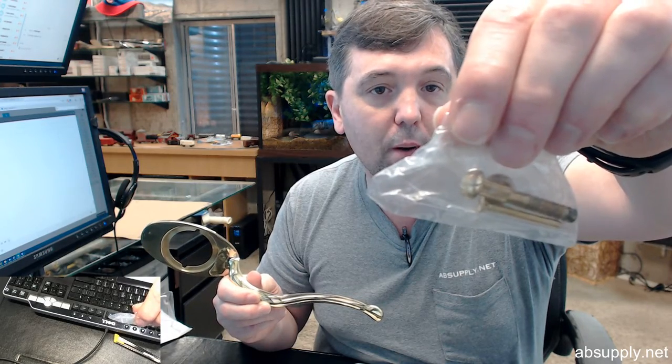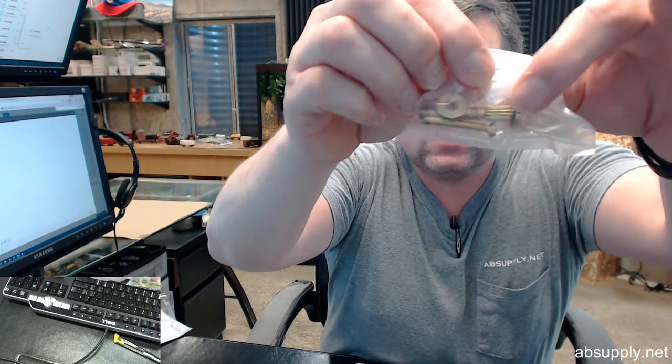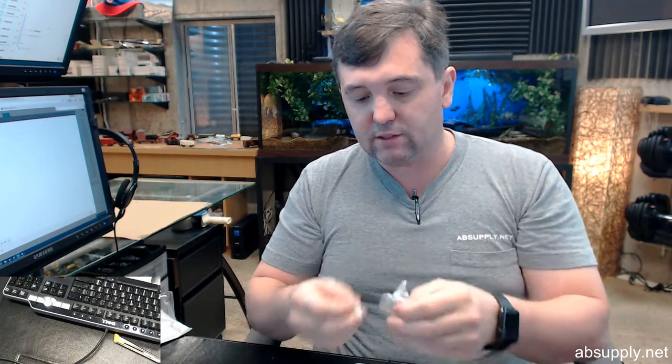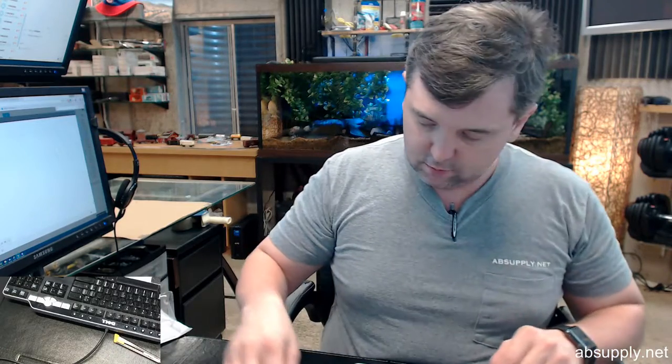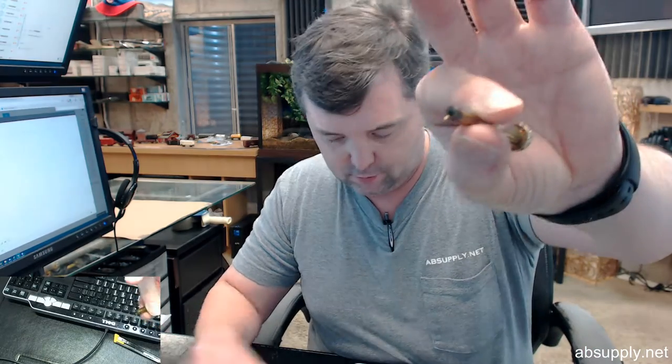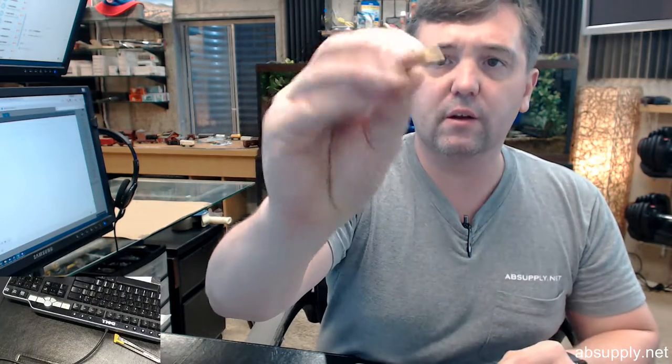Now, what you've got is one single through bolt, or sex bolt would be a more appropriate term for this. The sex bolt itself, you've got the interior side with this, not a decorative head, but just a round head that's on here. I'm going to remove it from the packaging. What you're dealing with here is the female portion. Then you've got a machine bolt with an oval head, and then a countersunk washer. That's what you're going to see on the interior of the door.